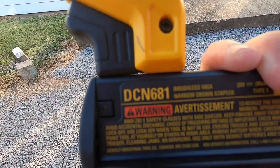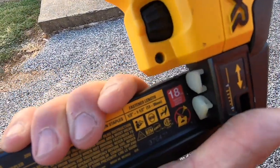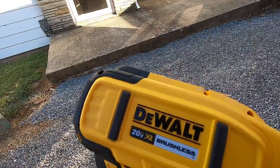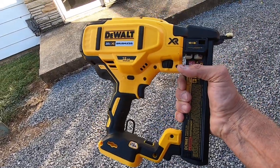I've had no issues with this fence whatsoever. Putting it up with a staple gun in individual planks is so much easier and so much quicker. This fence has been up for over a year with no planks coming out or falling off. The staple gun I use is the DCN681 — an 18-gauge narrow crown staple gun, 20-volt brushless. I've had no issues with it.